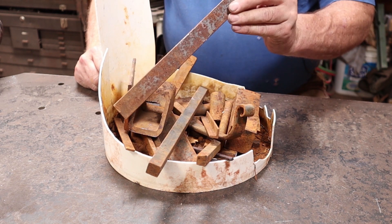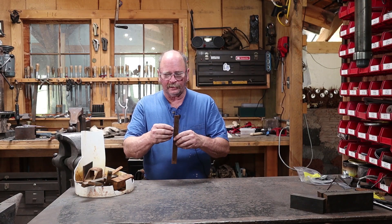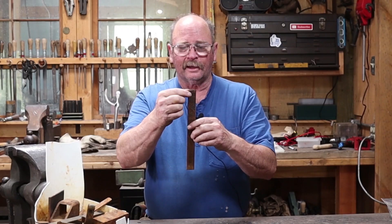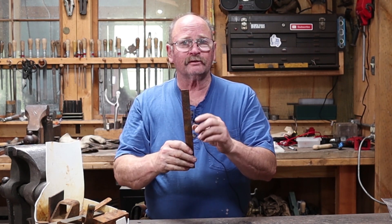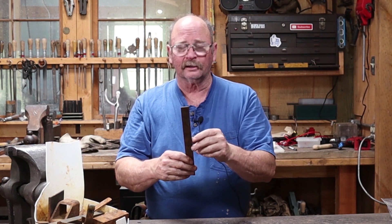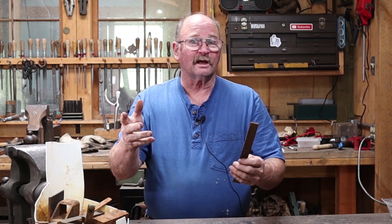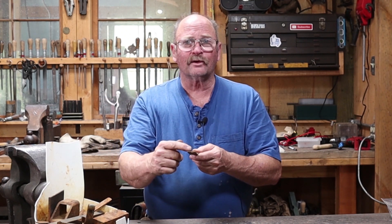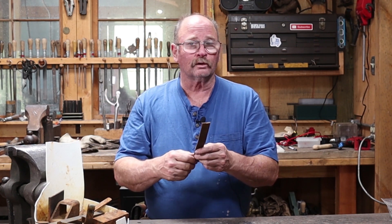How about we do something with this little piece of eighth-by-one flat bar? What I'm thinking is I'm going to cut it so that it has three points on it, then continue to split that down so we can scroll the top outwards and still have a center section with a little point on it. Not exactly sure how that's going to look yet, but we'll figure it all out. I'm kind of making a lot of these up as I go. We'll put a couple of punched holes in it. The other end I think I'll fishtail out and put a kind of a fishtail scroll on the end, then scroll it up into the hook.